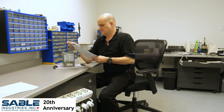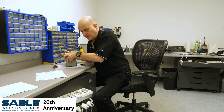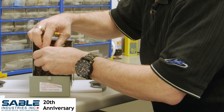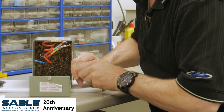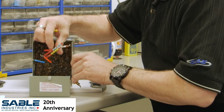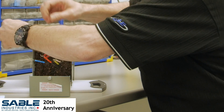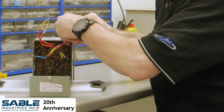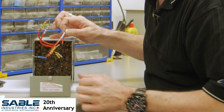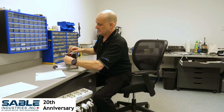By reading diagram number four on the bottom here of page 93, you can hook it up. All you need to remember is H2 and H3 — join those two wires together — and X3 and X2, join those two together. Now you're left with just four wires. H4 and X1 join to your incoming voltage, and H1 and X4 go to your other side of the voltage.